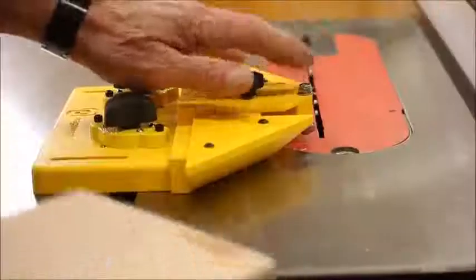Turn to the other angled side of the jig, and a sloped surface lets you hold down odd size thin pieces. Need to rip a piece of stock that's 3/16 of an inch thick? No problem. This angle will hold the stock firmly. But this jig doesn't stop there.